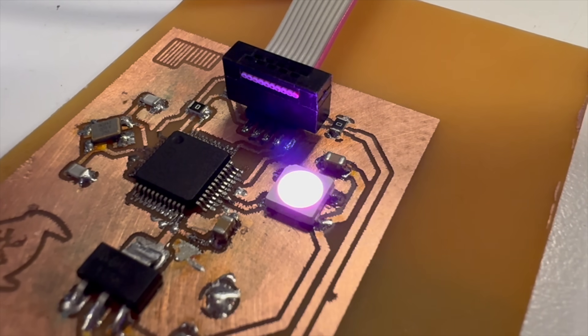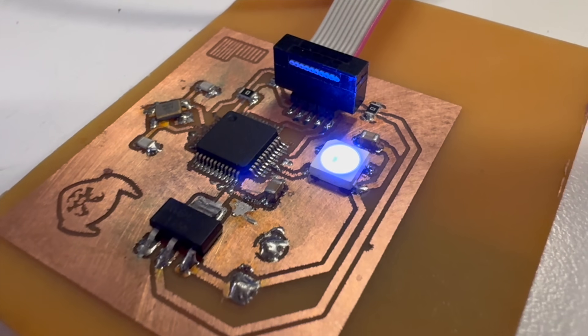Okay, with all this tuned, I'm dangerous — I'm cutting copper real precise now. I could just solder all the parts of the board and be done, which is effectively what I did in the last video — just getting my copper cut out, no worries about solder mask. But this laser can ablate solder mask, so why wouldn't we also do that?